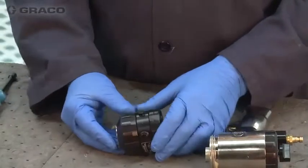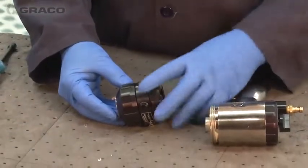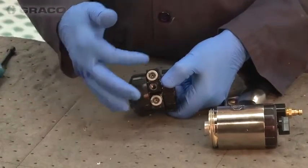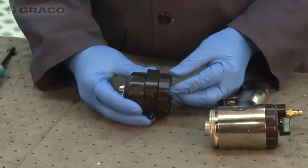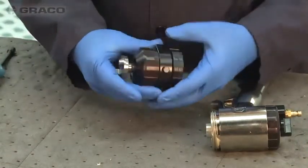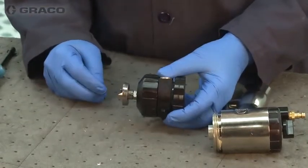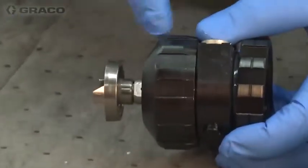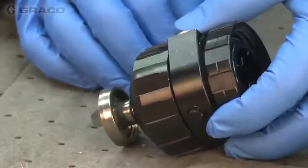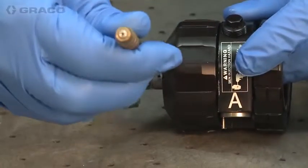What I want to be able to do is clean the mix chamber without exposing the internals. We also want to make sure everything's flushed out and clean before we get into this gun. So all we're going to do is push the mix chamber forward far enough to access the impingement ports. The side seal and the mix chamber is still intact, and I'm not leaking fluid there. Now I can gain access to the mix chamber to do any cleanup.